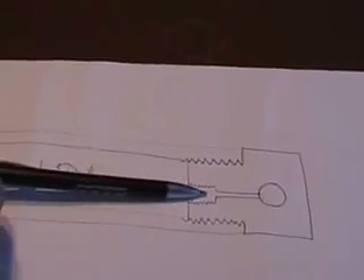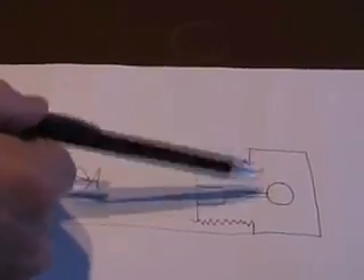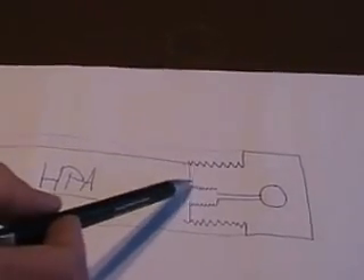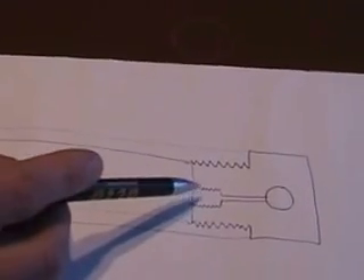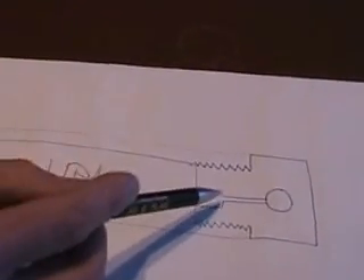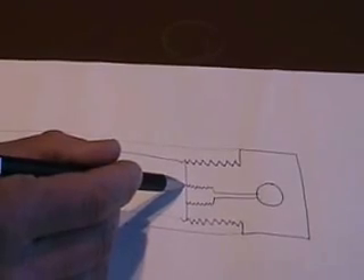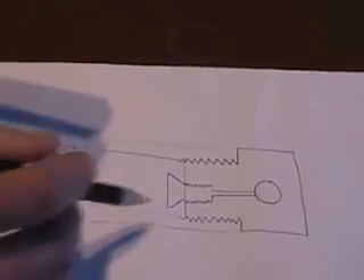The end plug is drilled from the inside — a tiny hole that goes out to the fill probe hole. This tiny hole would be enough with just 1 mm in diameter, or 1.5 mm or 2 mm if you prefer. This hole here is drilled and tapped for the screw. The size actually doesn't matter. The easiest way to make a check valve here, to keep the air from going out again, is to fit one countersunk allen head screw in this thread. It's pictured very oversized here. You can probably go with an M4 or maybe M5 size screw.